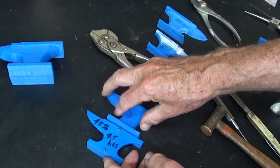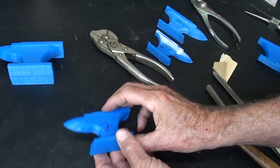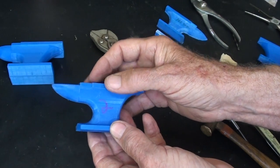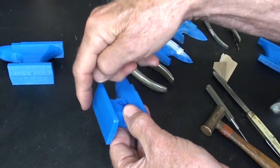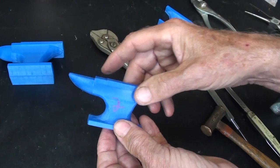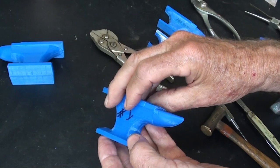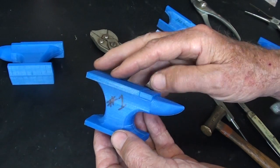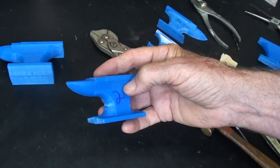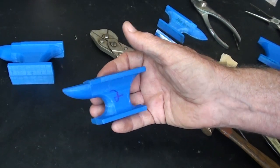I'm back — that only took 7 to 10 minutes. I also wanted to tell you that these PLA patterns would not serve very well in a school foundry, because sometimes when I had wooden patterns, the kids would actually forget to take the pattern out of the sand mold. So we would go to pour the mold and the aluminum would come into the sprue, into the gate, and then hit the wooden pattern — and then I knew something was wrong. There was just no predicting what kids would do. That would ruin the wooden patterns, and I'd have to remake them. So I converted almost all wooden patterns into metal patterns — what I call durable working patterns. That's what they do in a big foundry for production: all the matchplates are metal, and even those erode away from the sand over time and have to be repaired or replaced.